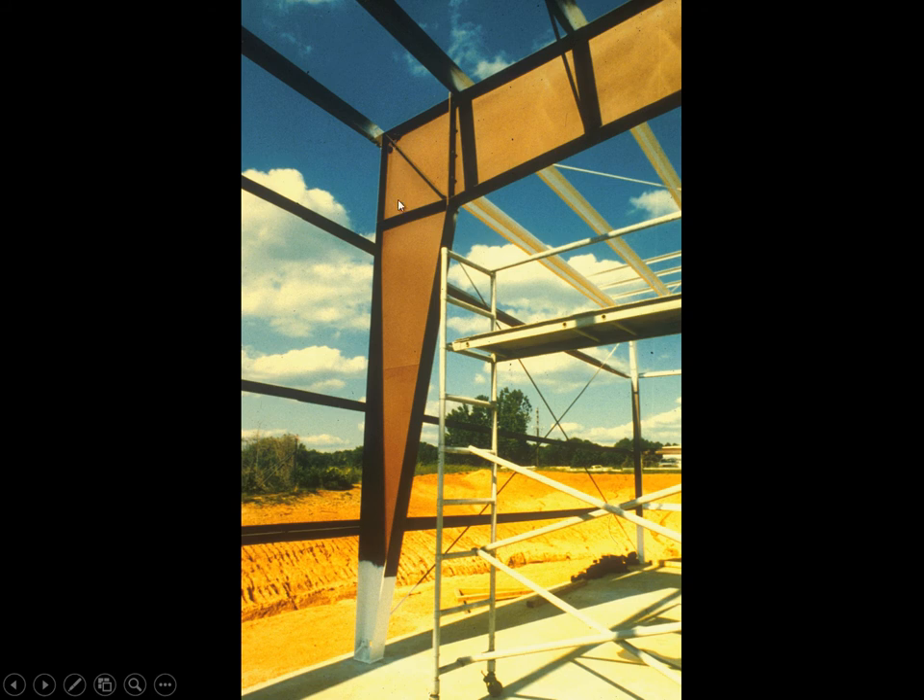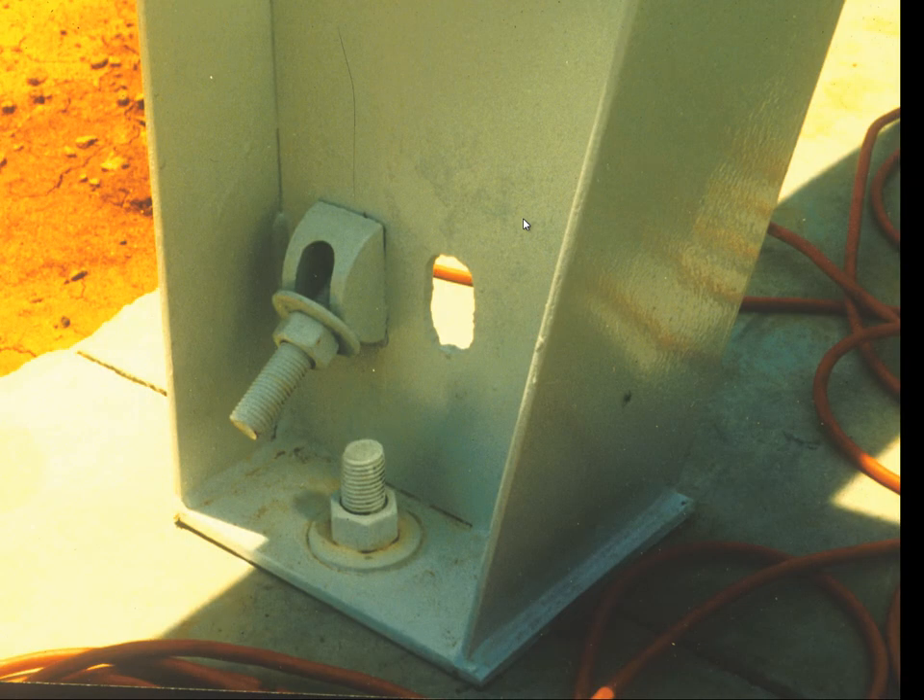So this column is pin-pinned relative to buckling failure in one direction, but table-leg relative to buckling failure in the other direction. If someone asks whether this is a table leg or a pin-pin column, you would have to say it's both — pin-pinned relative to one mode of failure in one direction, and table leg relative to the failure mode in the other direction. The base point is basically a pin joint in both directions because it has a very narrow base with only two bolts holding it, so you don't get any appreciable moment connection at the base.